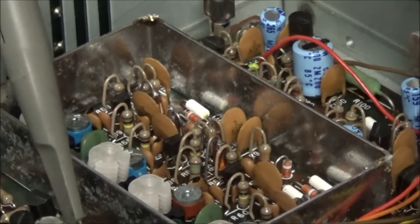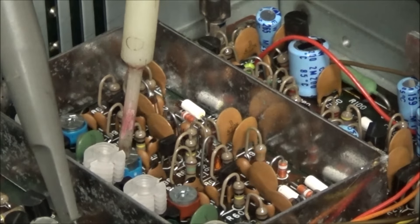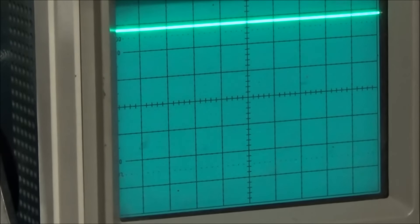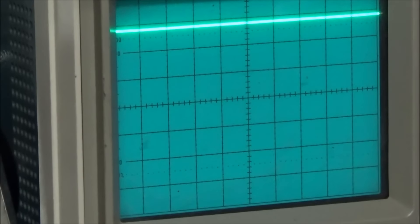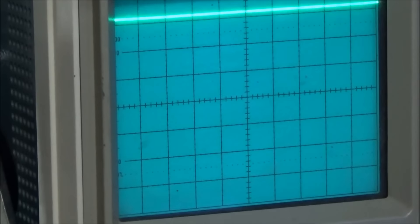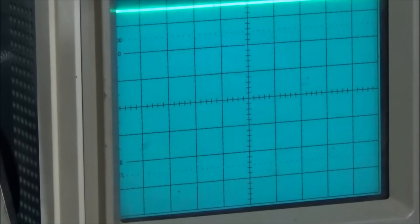I got it set to 21.9999 megahertz. We'll go to C96 — it should be here. We'll look at the scope, turn the generator on to generate. We've already got a tone and we're sitting just below 6 volts. Really dirty terminal. Okay, we're locked on about 6.5 volts.